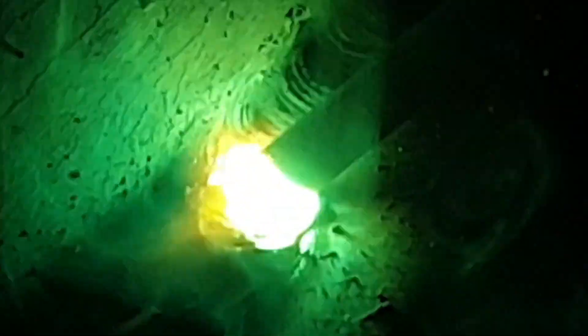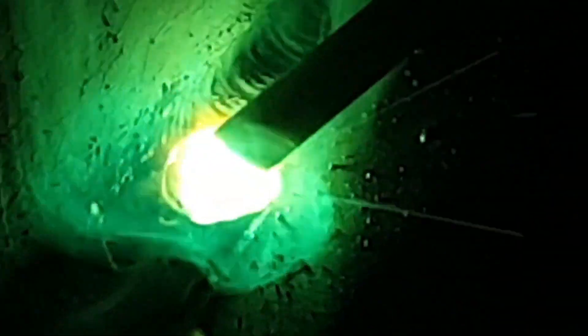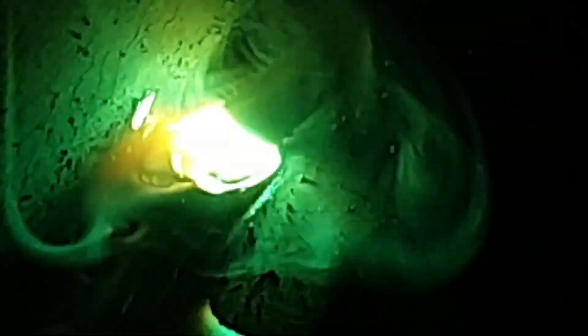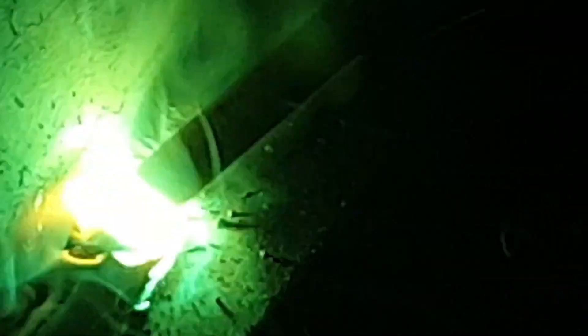It's important to note that our amps are exactly the same as the first run. The only difference we've changed here is our rod angle, and that will change consistently depending on the type of joint you are producing. Stick welding is one of the most difficult welds to master, so you've got to pay close attention to the arc — watch that arc closely while welding. It's going to give you the feedback you need for your weld and your technique, especially if you go into difficult joints like 6G pipe welding. This technique will still stand.